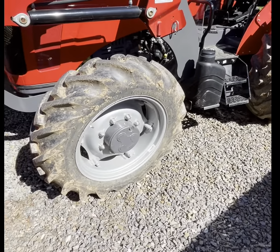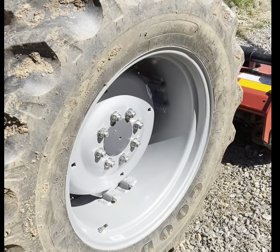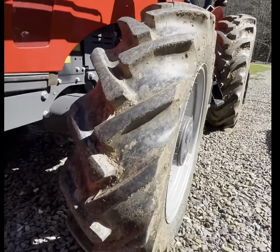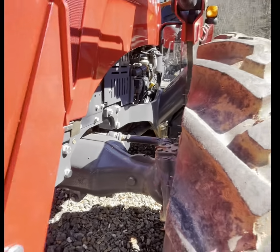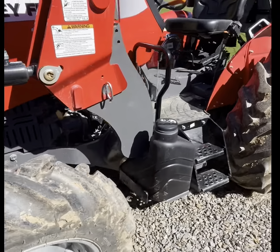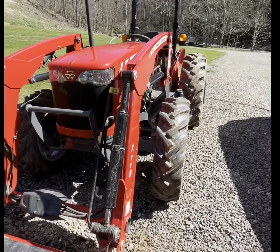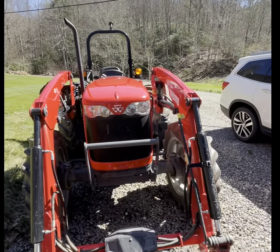You can change these — I don't know what you'd call them, the pans and the wheels — and adjust it so the wheels stick out further, giving you a wider stance. Something else about this tractor is the differential is offset so that the tractor can sit a little lower to the ground and it's not right underneath the oil pan. It gives you a lower stance. I don't know the exact measurements compared to the Kubota version, but it is a little bit shorter.